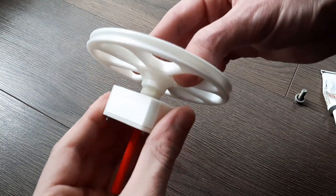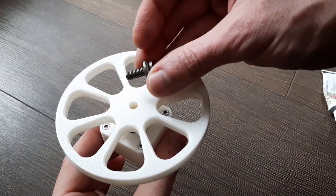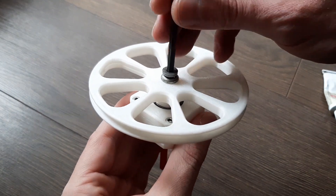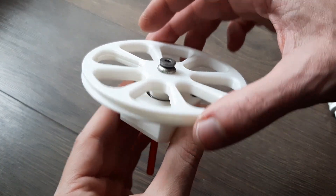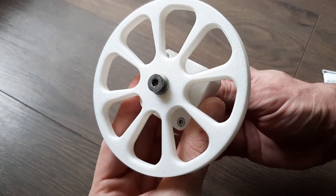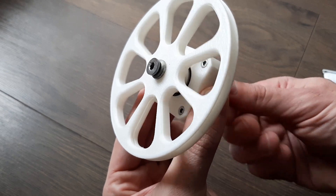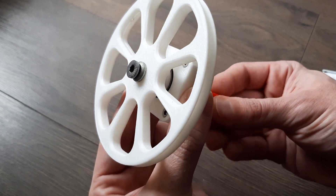I designed this wheel connected to the shaft so I can put some weights on it and see how long it takes to destroy this gearbox. It does have 3D-printed fittings for screws. There's not a lot of slack or backlash, but this can be mitigated in software. Spinning this, you can see the wheel spins in the other direction.